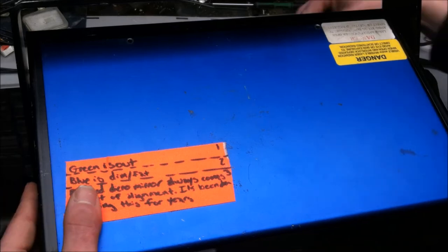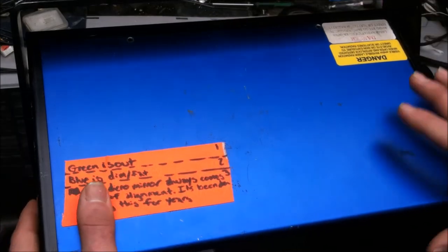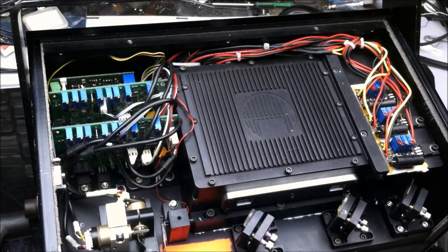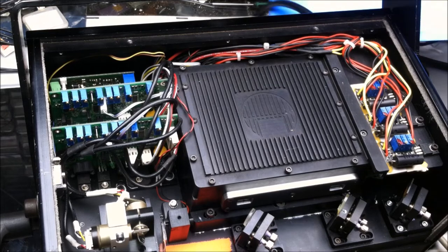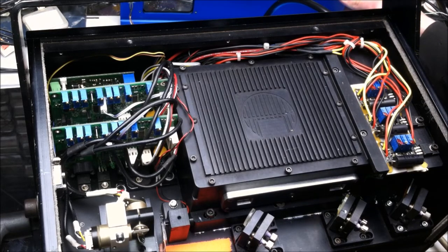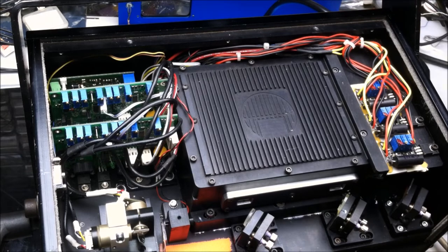Let's pop this open and see what is inside. That's familiar. Hey, this one's marked Azul. That's blue. I know what that means. Well, these are definitely laser drivers then. Oh, okay, that makes sense. Ground, voltage, M for modulation. Duh.